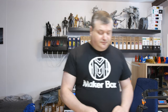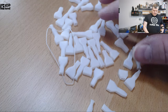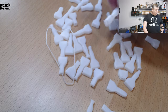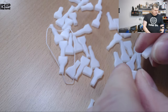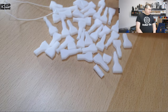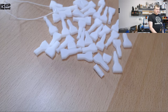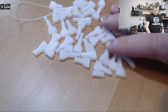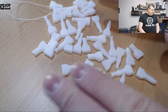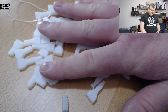It's a pretty cool filament. Let's have a look at some of the prints I did. As this was a new type of filament I'd never seen before, I did the brake tests and found out it's a really tough filament. It stretches quite a bit before it breaks, and the layer adhesion was a little bit better than PETG and nylon. It gives a little before it breaks and then snaps.